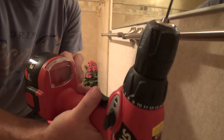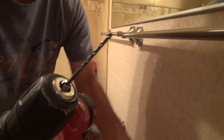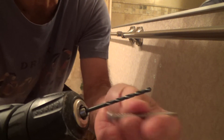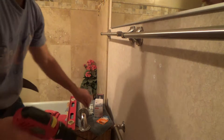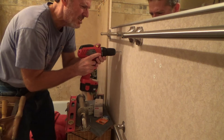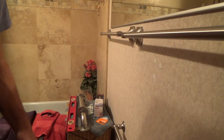I've got a 12-volt battery-operated drill. When you're at the store, get the 18-volt — they last much longer and are more powerful. This drill bit is just a little bit smaller than the screw, and I want to keep it about the same length as the screw too so I drill in as far as the screw will go. I pull it out a little bit each time to clean off the debris. Now this screw is going to go in nice.